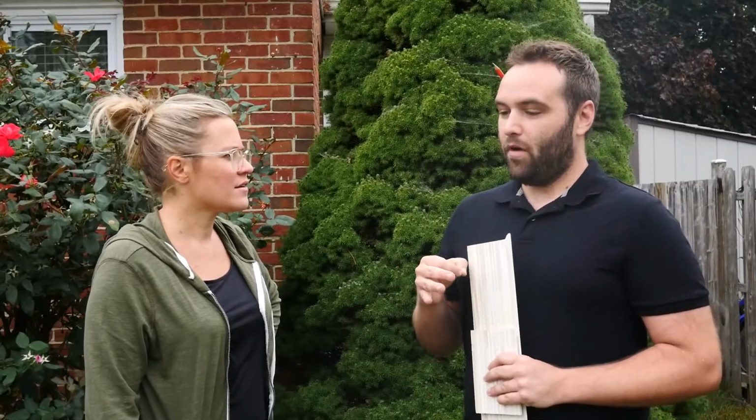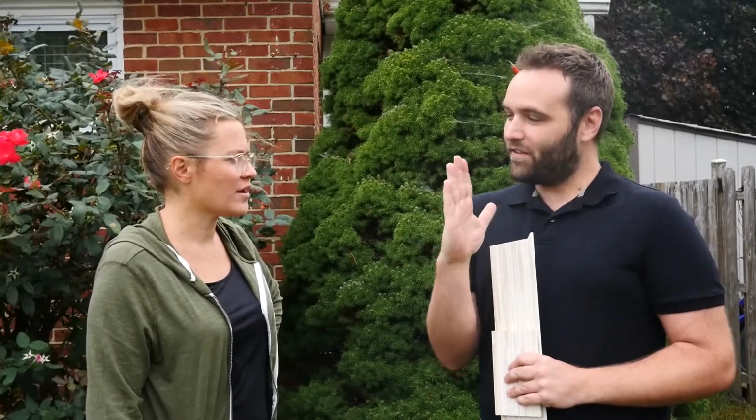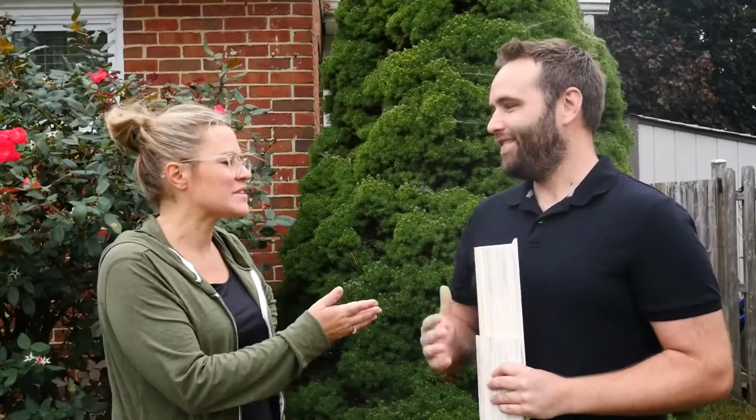Everybody marks a little differently. So some people make a mark right on, and so when they go to cut, they just barely leave part of the line, so they're almost cutting the line in. Other people make a mark just over, and they'll just cut the line out completely. Other people make a mark shy, and then leave the line. So it kind of depends. Working with somebody, they go, "Oh, cut the line." That's just, they know what their mark is. So when you're working with someone, it's really important to communicate about whether. So typically, if they give you a piece, you'll say, "Leave the line."